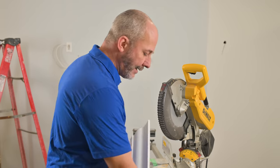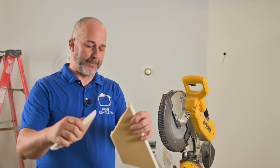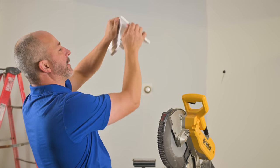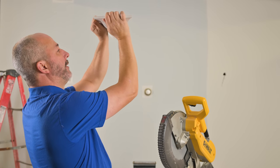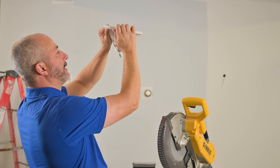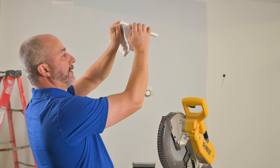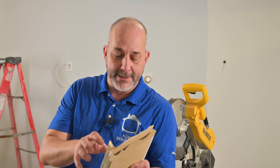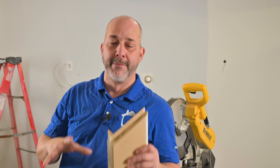Now here's the best part — this is why I have these jigs. I can use my test pieces when I put something up on the wall and put them together. If everything is perfect it'll be a seamless joint. But if I've got something too high up on the wall it'll roll open like this, or if I'm on the wall wrong. So these little jigs keep everything perfectly square. I don't install it on the wall until it looks like it's one piece of material. So let's take the jigs and our material, hook up our air compressor — we're going to need brad nails, two inch, using an 18-gauge nailer — and a caulking gun with the crown molding caulking. Not regular latex or all-purpose or door and window or painters — get the right stuff. It has a bit of an expansion-contraction material, very important near a ceiling because during different times of the year the ceiling can get really warm or really cold and you don't want your material cracking over time.